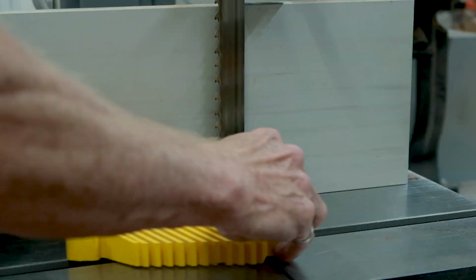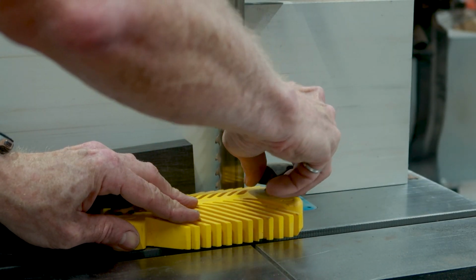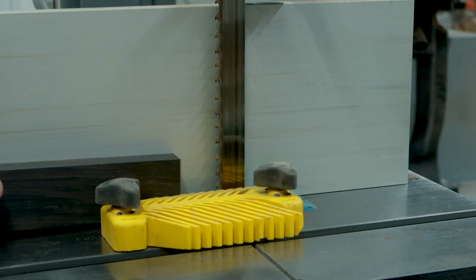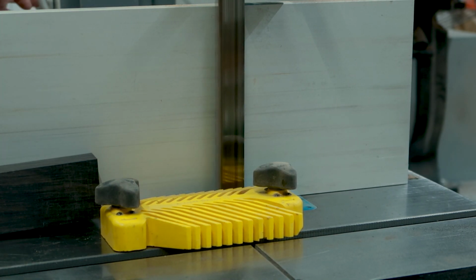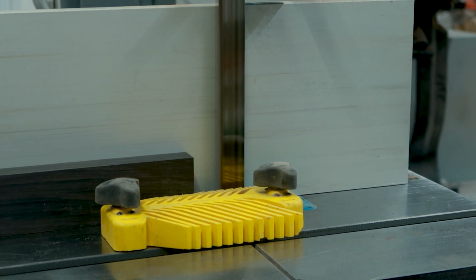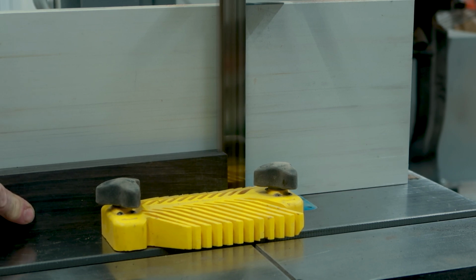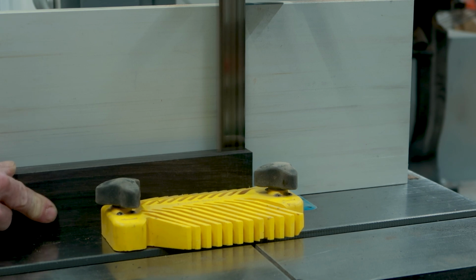The frame is going to have concealed magnets to help keep the 2 halves together when the board is folded. To conceal the magnets, I'm resawing the frame piece so that I can insert the magnets from the inside, and then I'll glue the 2 pieces back together again. I've marked the edges of each piece so that I can glue them back together correctly.